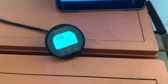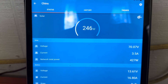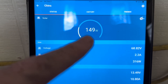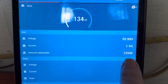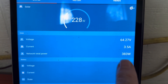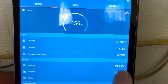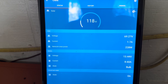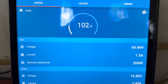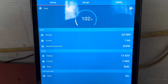Now bouncing back to the Chins battery pack — 54.9% full. You can see how the clouds roll in and drop the wattage down. Looking at the network total power, since I've got both strings and charge controllers tied in, out of 1000 watts possible I'm fluctuating — 383 watts when clouds roll through, then it jumps back up when the clouds roll out. Both strings hit 900 watts, then down to 500. Chasing the power around — that's why this battery pack has not reached a full charge in the past couple of days. You get a second or two of full power, and then we're at 100 watts off a 500-watt string, and the other string doing about the same — 203 watts total.